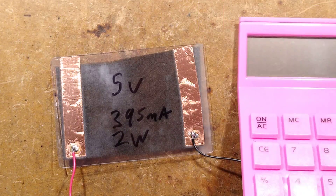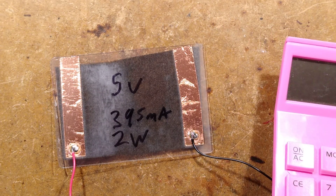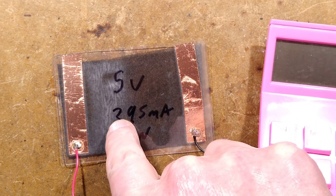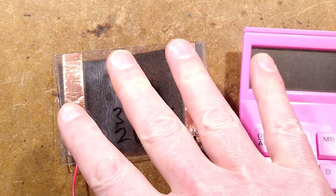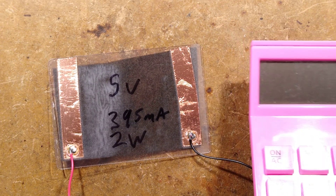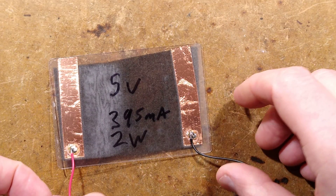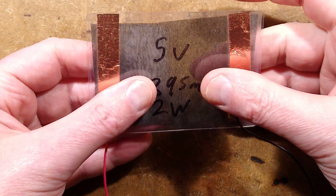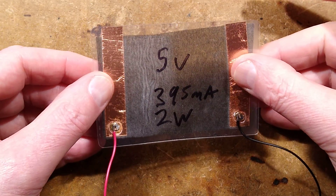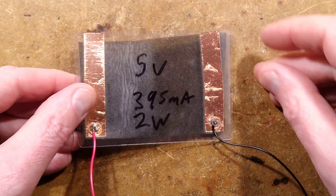It's current regulating — up at 16 volts, 1.2 amps. The current's wavering up and down and actually going down now. I can see moisture coming out of the fiber in there and that's actually separating it. It's settled at 16 volts, 1 amp — 16 watts — and it is starting to show signs of rippling. That is very hot. It is getting soft now.